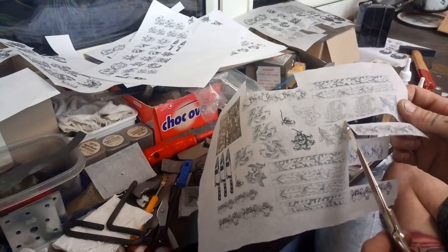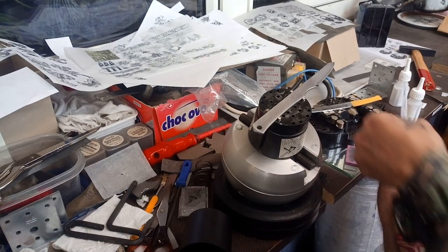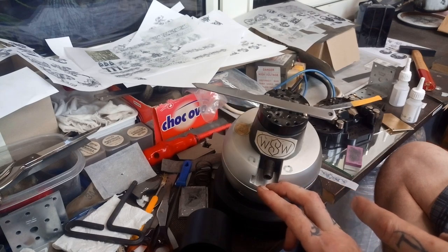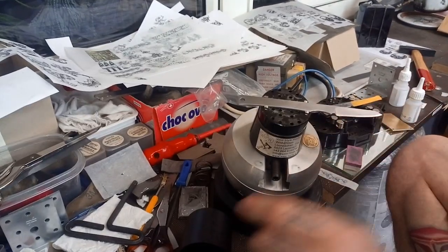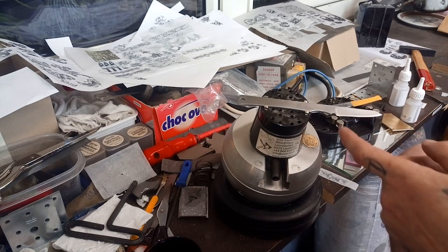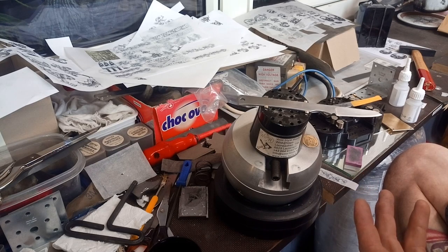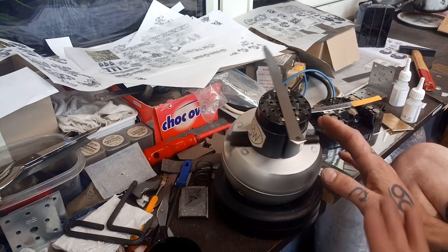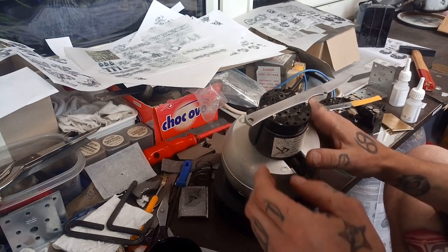These knives are already finished — I made them for engraving to personalize. It's a very nice steel, it's a multi-layer Damascus. It has a VG10 core and V2A — stainless but not hardenable outside layers. After hardening it's still soft outside but the cutting edge is extremely hard, so you can bend and re-bend the knives. The outer layer is not hardenable so you can engrave it.